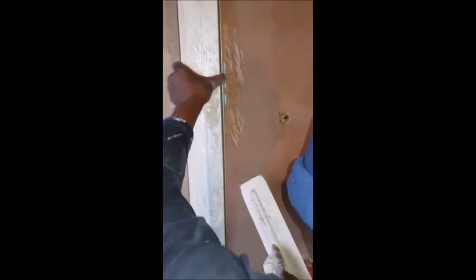100% straight. I'm going to put it against this angle bead, and as you can see, there's a big gap between the top and the bottom. So we need to adjust this bead, and how we're going to do it, we're going to cut out the whole of this section here and try and move the bead over to straighten it.